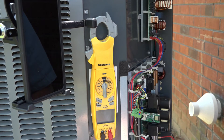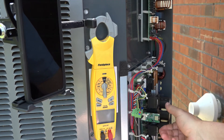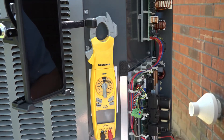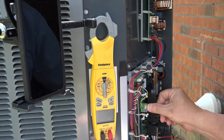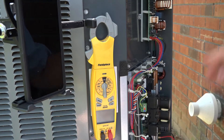Once we're satisfied that all the data has been transferred, I can power the unit down. Once the power is down, I can remove the chip off the board and turn the chip off. I'll re-plug my communication plug back up to the board, making sure I've got it aligned to the right pins.